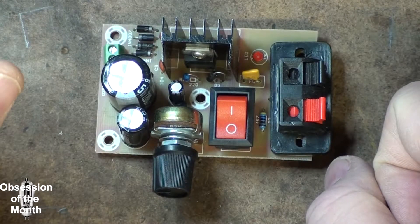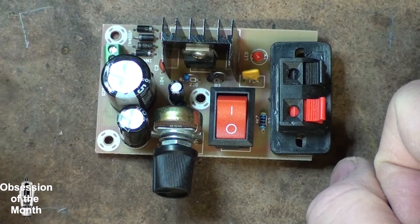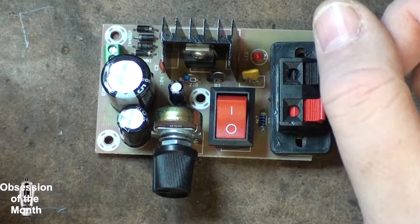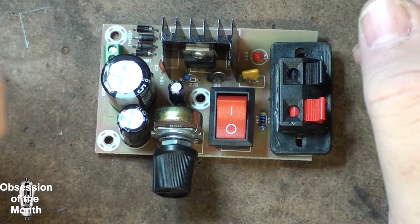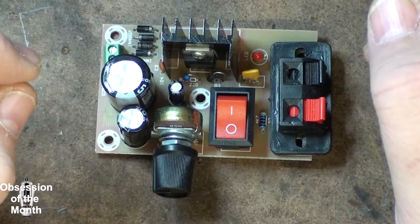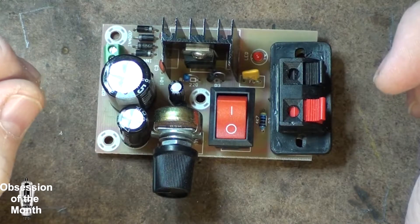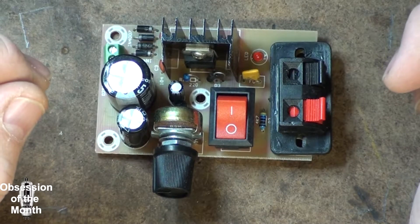Some of the things to look for when you buy one of these: the LM317 is a pretty nice adjustable voltage regulator, but it has some issues. One of them is it does not like getting short circuited. If the input voltage and the output voltage are off by around five volts and you short it, you'll fry it. In other words, if you want 5 volts out and you give it 10 volts and you short it, you can fry this chip.